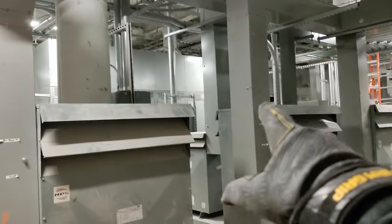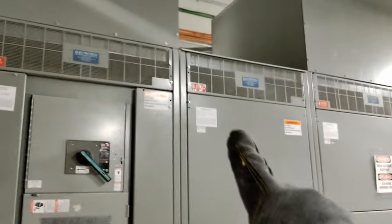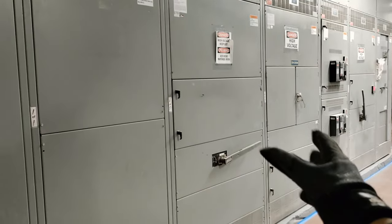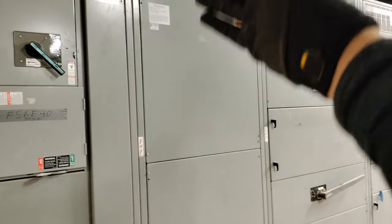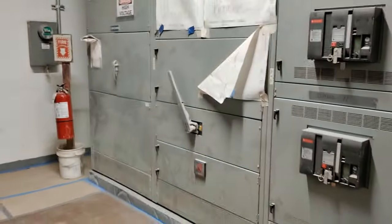You have two services here, two over there, and two over here — so this big stretch is actually two. This is phase one, meaning there's going to be another phase where we have to take out this middle section, because this middle section is what's temping out this service from that service. There are bus bars in between here that bring power from one service to the other temporarily. When we're ready to land these, we'll take this transition piece off — it's just bus bar plates joining the two services together — and then there will be two independent services.